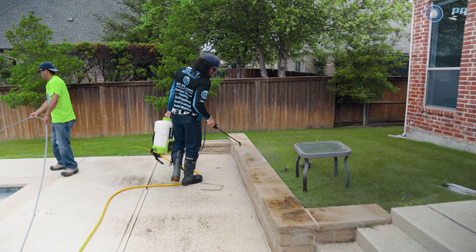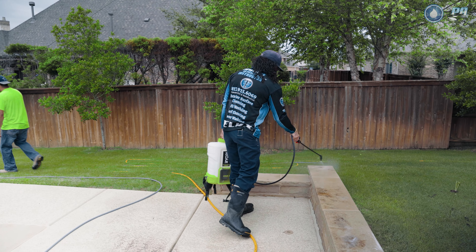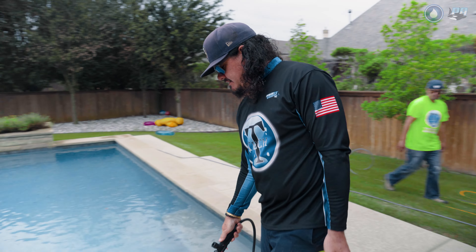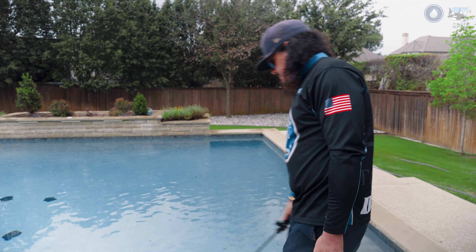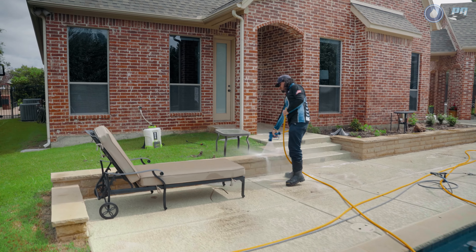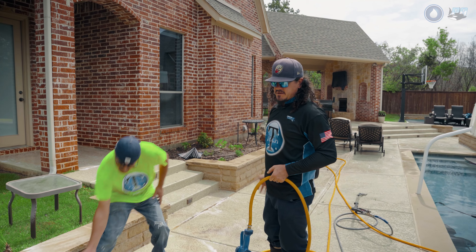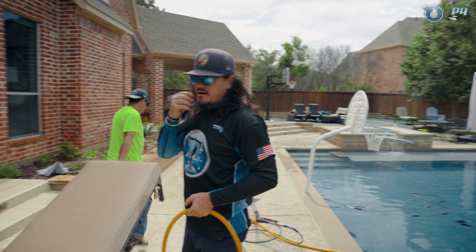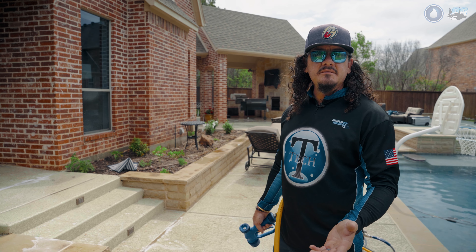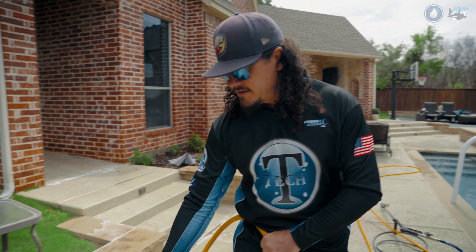I'll come back and look for any areas that might be drying up. This stuff will pool in some areas and stay wet; some areas where it runs off it'll dry a little bit quicker, so I'll just go through and touch up anything else that I need to before I start working on another aspect of the job. All of that growth on top of the stone is starting to disappear — we're probably about 10 to 12 minutes in since the first application, and I like to shoot for 15 minutes of dwell time. If it's pretty close to being gone at that point, our mix is going to be right where I needed it to be.